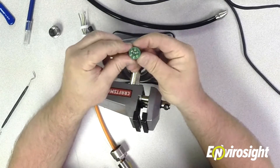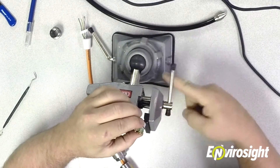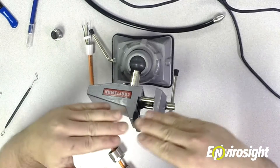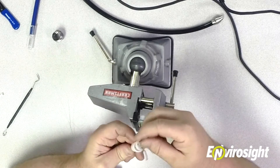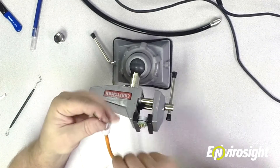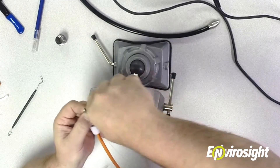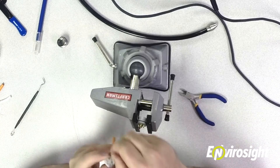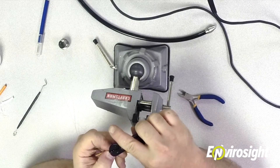Next, take your solder cup — it has a notch where it goes into the crawler. You want that notch at the 12 o'clock position when you lock it into your vise. For this termination I like to start at the bottom and work my way up, because it's easier and you're not overlapping wires. Dead center bottom is going to be the black wire. I stripped back about two inches when I started out, so at this stage I like to trim off about another quarter inch to keep the wires short and everything looking neater.